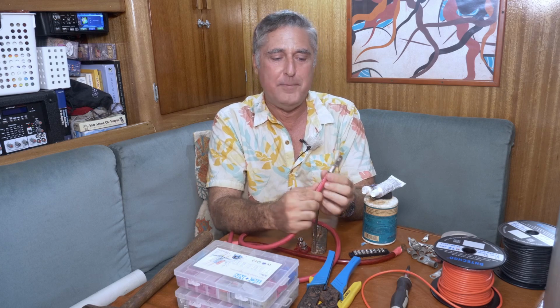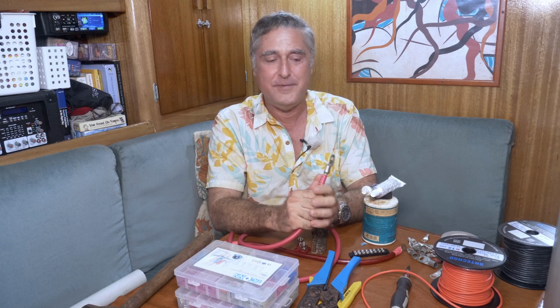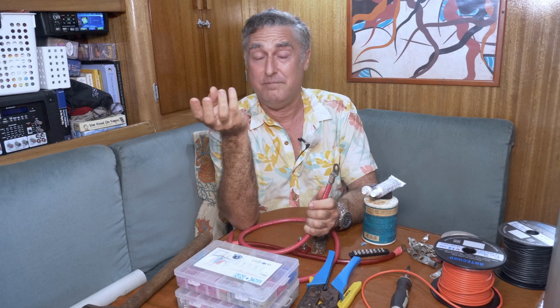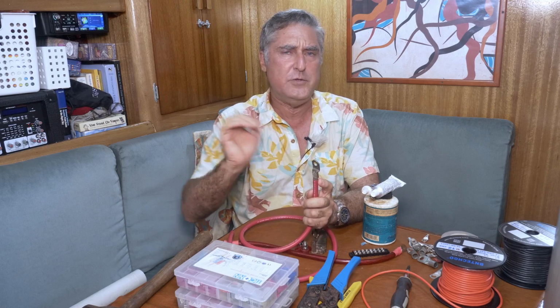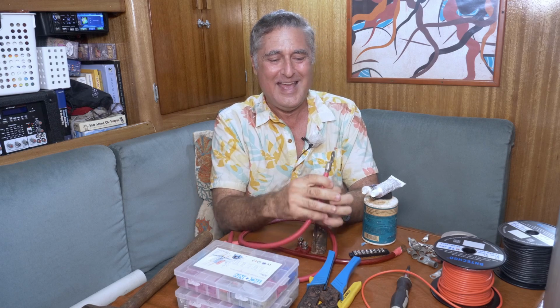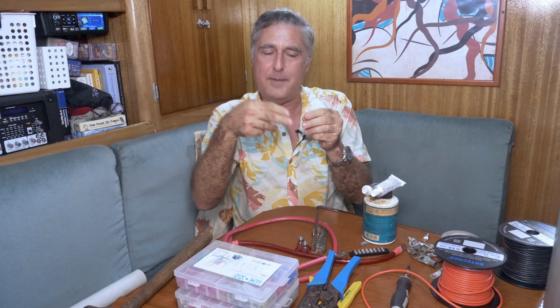What you're going to find a lot of people recommend, it's kind of the official thing to use, is called dielectric grease. It's also called tune-up grease. And what it is, it's a grease. Greases are great. They do all kinds of stuff. It's not just for lubrication. They keep oxygen away. It's like a little wall all over things. Dielectric grease is grease that will not conduct electricity. Now, if you've got a little connector with a lot of pins close together and you want to protect it from oxidation, use dielectric grease.